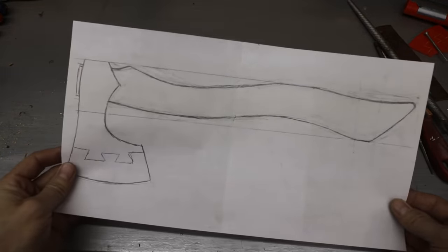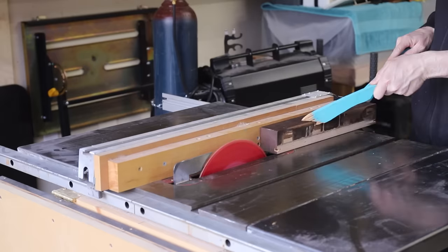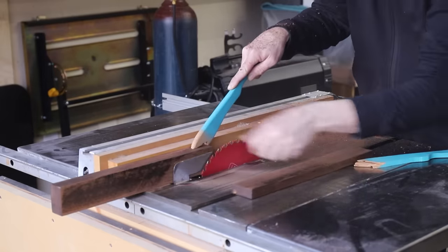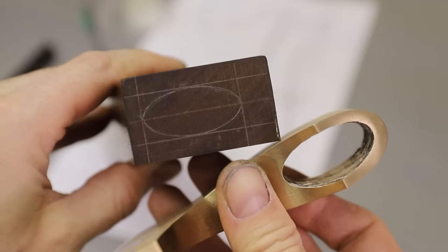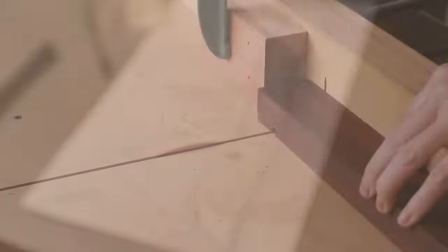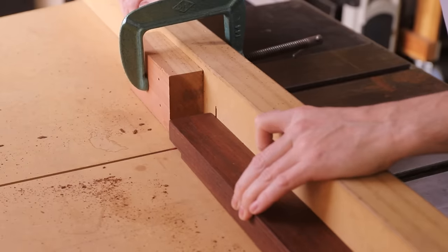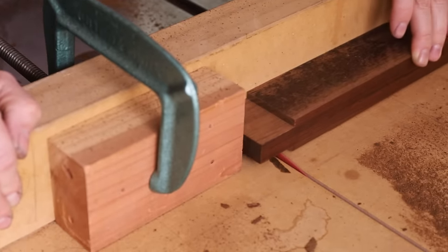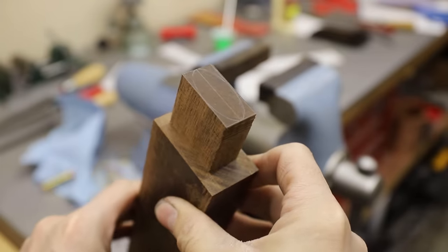Now I can start working on the handle and here's what I sketched out. I'll cut it out of this piece of walnut from an old table leaf. Once I had it cut to the right thickness, I laid out where the eye is going to fit over it — that's what the hole in the axe is called. I've found that doing it this way really helps with getting the head mounted nice and straight; otherwise it's really easy to get off track and end up with the head crooked in more than one direction.